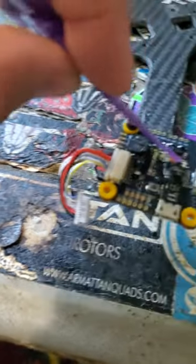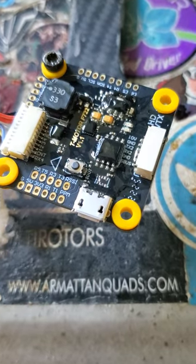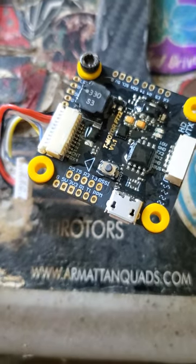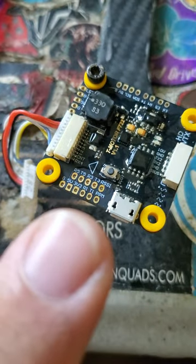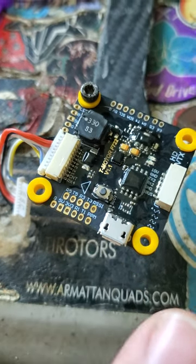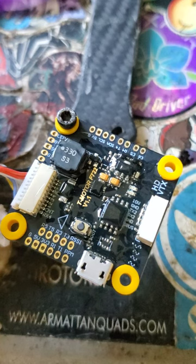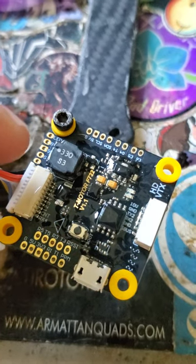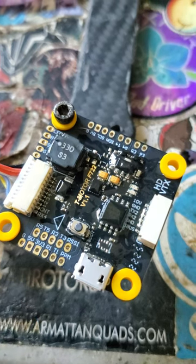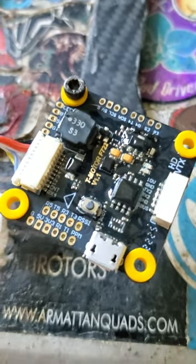Should have tightened this down a little bit more - it's drifting. Hang on. And there she is, all ready to go. So again I left my pads open here so that I can solder that clean. My port is open. I did everything up to the edge, leaving the pads where I can get to them. And then when I solder this in I'm just going to take another dab of conformal coating and cover right up over the joints just to seal the deal.